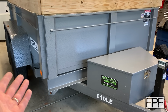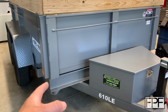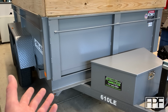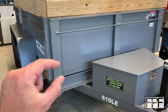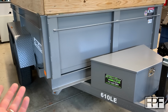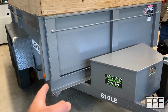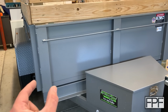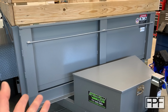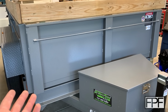I didn't have the same design constraint that the original designer did when they chose that part for this trailer. I mean, I'm sure that's a pretty standard part. And they were limited by the amount of squish that it had. Maybe there's different durometers offered. I'm not really sure. Clearly it wasn't the right size, or the holes were drilled in the wrong place. But that said, the distance that the hole was drilled from that side was identical on both sides. If they made an error, they made the exact same error on both sides.